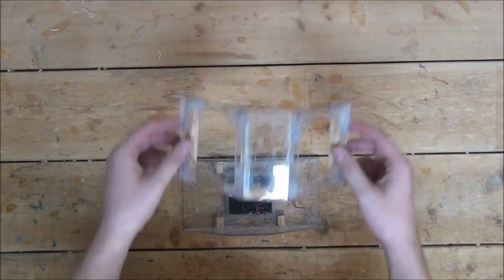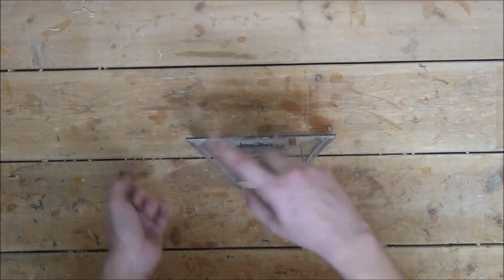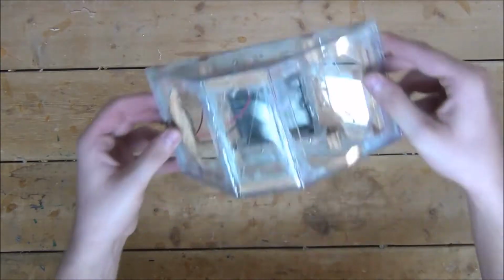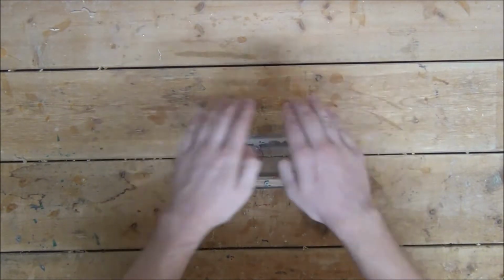After that, we can pop the front plate into the back plate, then drop a screw in the front and both sides into the oak wood, flip it over and do the same on the bottom. Just like this. Then lastly, before painting, I'm going to take some sandpaper and round off any sharp edges.